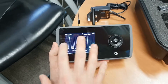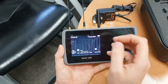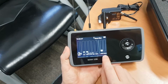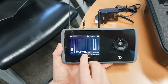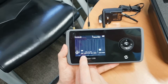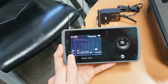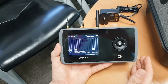On the main screen it shows the three different types of scanning. On the far right is the Wi-Fi antenna showing 2.4 and 5 GHz — both frequencies Wi-Fi uses. In the middle is cellular, showing different band types; in the UK we mainly use 900 and 1800. On the left is the wide band, scanning across a range of frequencies and displaying the strongest frequency it picks up. This is a live feed of what's currently being detected.